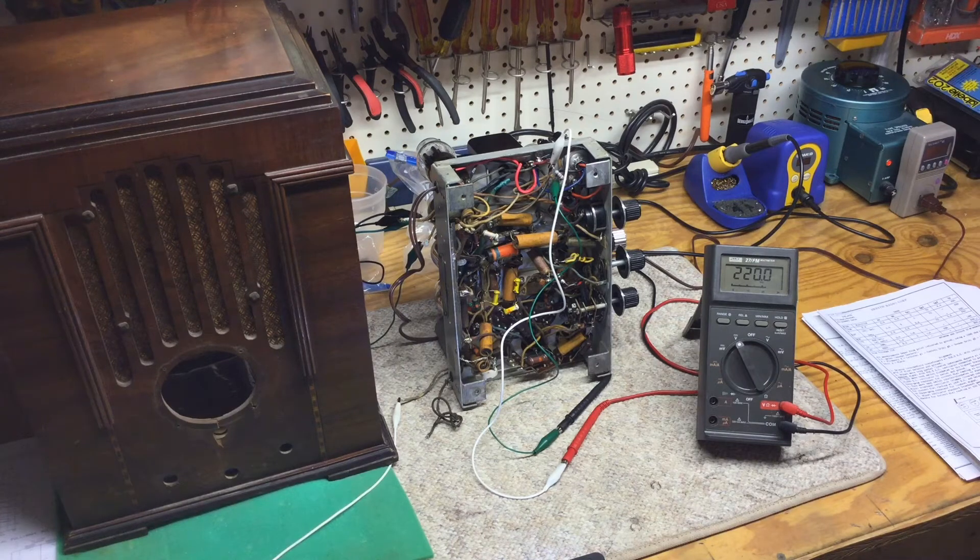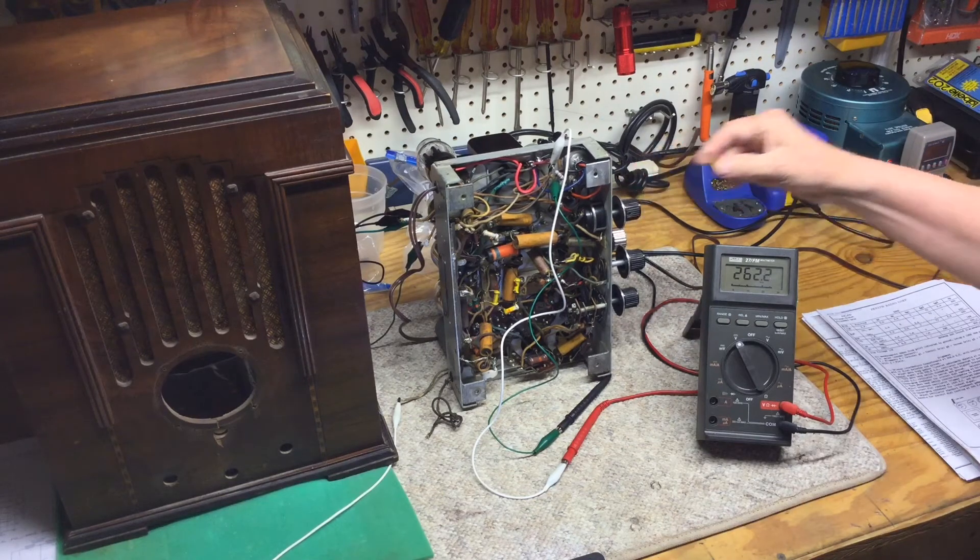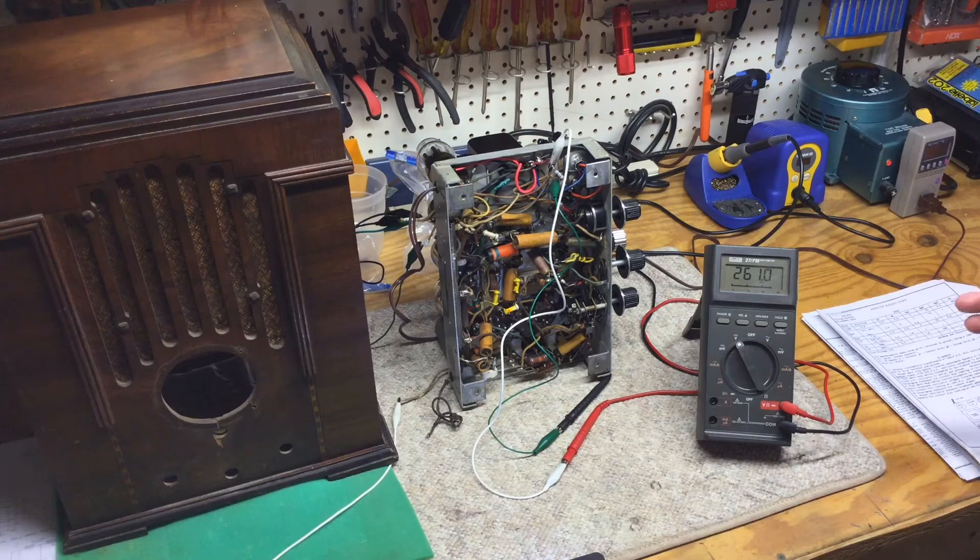I'm at 78 volts input and I've got some output noise — that's a good sign. I'm now at 90 volts, so I'm going to turn the volume down some. Quickly toggling back: I'm at 0.37 amps of current, and my DC voltage is nice and steady at 260 volts — that's a good sign. I'm at 0.37 amps of AC current. I'm probably not going to go any higher than about 105 volts or so. I'm at 96 volts, then 103, 104 volts, and I'm at 0.45 amps of current.